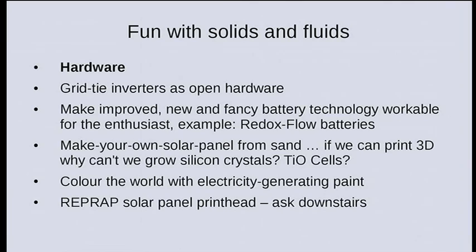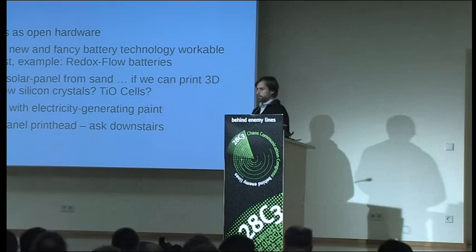You need one of those boxes as open hardware, so everyone can have one. If thousands and thousands of people have one, well, Vattenfall has to be convinced they will allow it because it's reality. And basically, this grid tie inverter is nothing else. If you have the thing for your car, you put in 12 volts, you get 230 volts for your laptop in the car. That's the same thing. It's only the synchronization to the net that's different. And the box for the car costs only 40 euros, so this should not cost too much more.